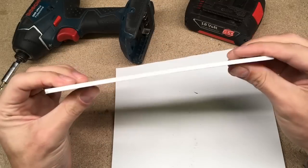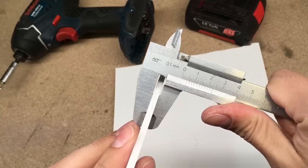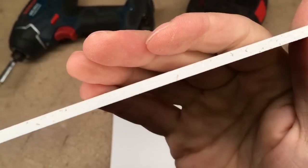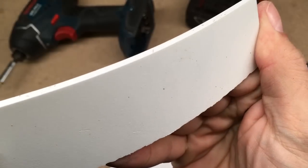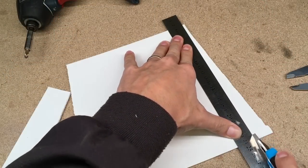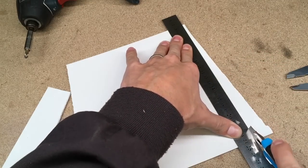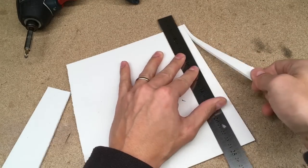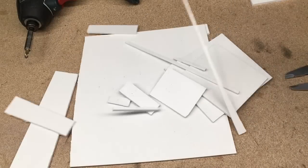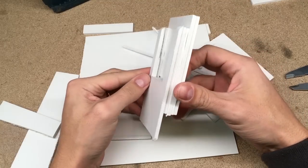As the main material I used 4mm iron-plast SB board. This is some kind of polystyrene with both sheet surfaces covered. It is lightweight and very easy to work with. Here is what's left after cutting and gluing sheet on sheet to get a rough adapter shape.